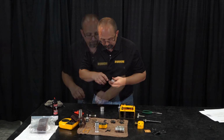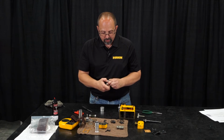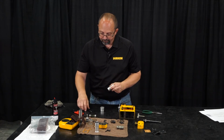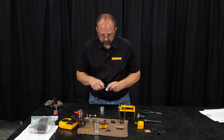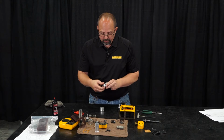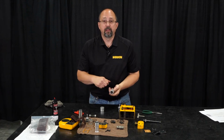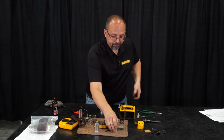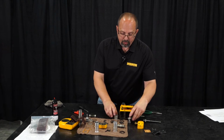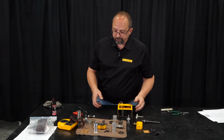And then we have our brake spool bushing, which has to be sealed against the housing to prevent air leaks. Since we're replacing the O-rings, we don't have to worry about overstretching them. Just grab a hold of them and basically yank them off of there. Okay, so there's all the pieces and parts from our valve body. Looks like a lot, but it's actually very simple.